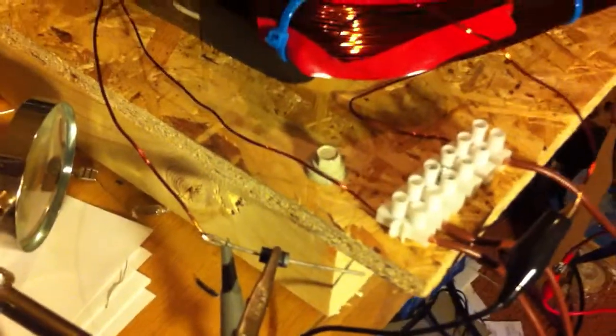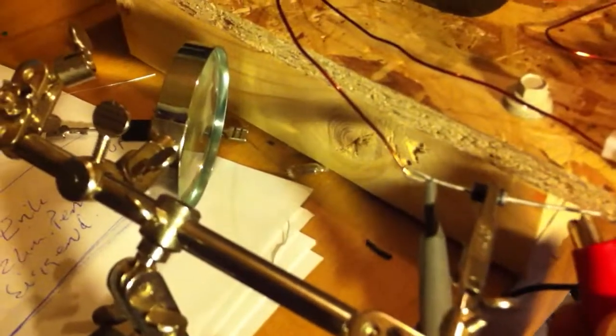I can increase the negative voltage and also the positive voltage. I can increase it by connecting just a wire to the other end of this diode. I have a 3 feet, 1 meter length of wire, just a test wire I have here. When I connect this wire, the voltage increases across this diode.